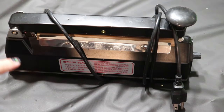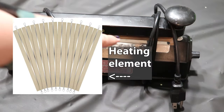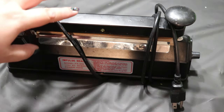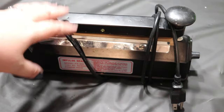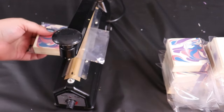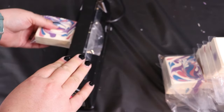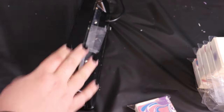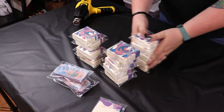Now that all of the bars are in their bags, it's time to go ahead and get them all sealed up with the impulse sealer. This is an eight inch impulse sealer — we got it from Amazon. A quick note: there is a little thin wire metal piece inside that sometimes does snap and that'll make it so that your impulse sealer does not heat up. I really recommend buying the extra refills on that when you pick one up, so if something does happen you already have the part. For the polyolefin bags I have the heat setting to about a four. I like to do them in stacks of five — anything more than that and sometimes when you go to shrink wrap them, they will fall over.